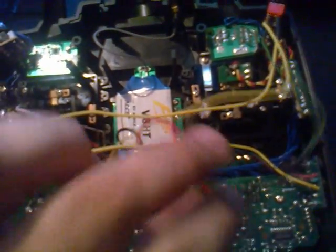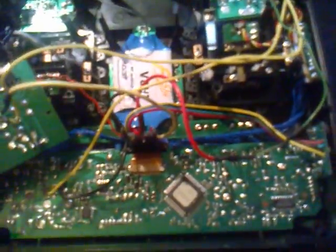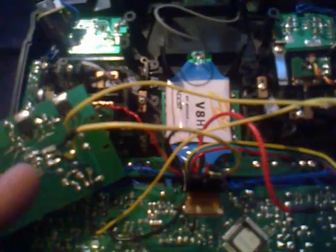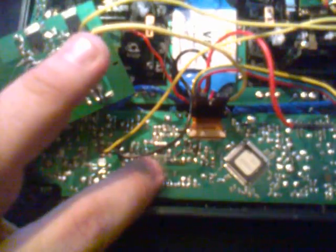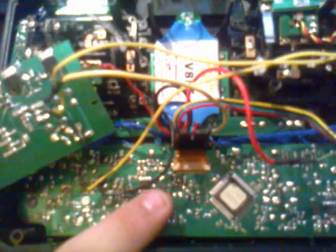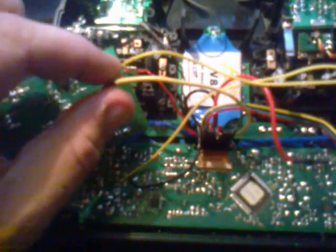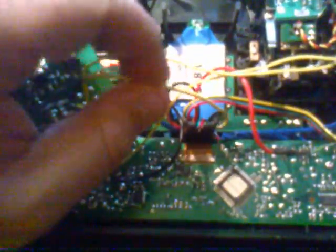Then there's a red one for power and a black one as ground. The main thing is it has to be connected to the trainer port. The signal coming from the main PCB board will not be PPM, thus making it not work — it will only work with two channels and not the rest. So you need to get a real PPM signal.